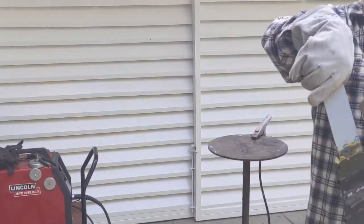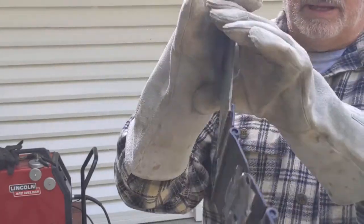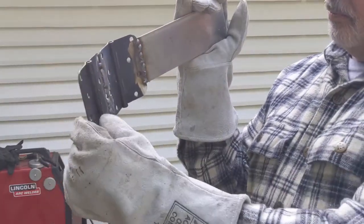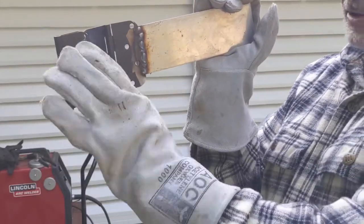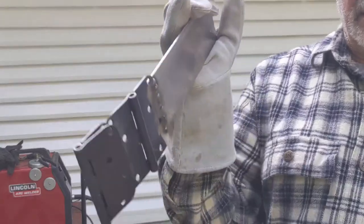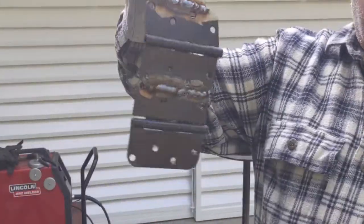Okay, so I've got this totally welded up now. It's basically two hinges and a plate. And what it's gonna be, I'll show you on another video, where this actually becomes a way to hide an electrical breaker box. This will fold over and there'll be a picture mounted on this one and on this front hinge. So the hinge will be allowed to pivot away from the wall and then out. So you can pivot the picture out away from the wall, and it'll be just mounted to a stud here. So once this cools, I'm gonna paint it,